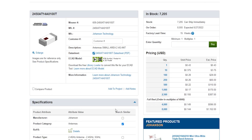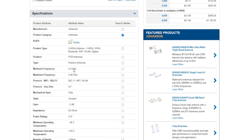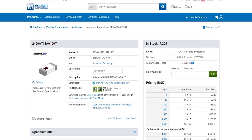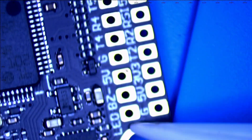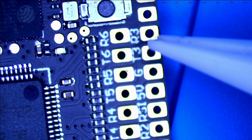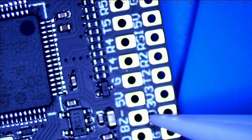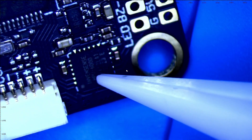The antenna is a passive PCB SMD ceramic antenna — just like an antenna you'd twist onto the back of your quad but integrated onto the board, with its own frequency, gains, impedance, and power rating. Moving along, there are a bunch of connections on this side for anything you might want to connect — GPS, receivers, whether it's FrSky, Crossfire, TBS, or anything else. On the back side, you can see the MPU-6000, which is your gyro — that's how the flight controller knows where it is in space.